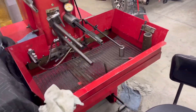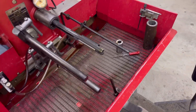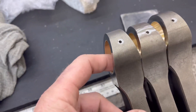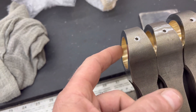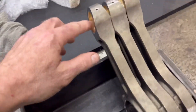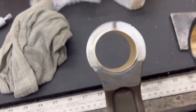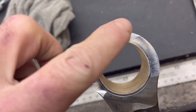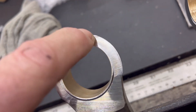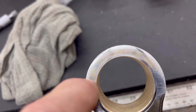Almost enough time to justify me doing a rougher grit on a different mandrel. I don't want to have to change the mandrel, but I could pop it out and have a sander close because when I'm honing it, it does leave a burr on the outside. I need to touch off the burr on the outside and constantly knock the burr on the inside. I keep a file right down here so I can knock around it real quick as I'm honing it out. See, I got a little bit of the factory left — that's factory, I didn't sand that away. Left most of the factory lines but sanded it all the way.